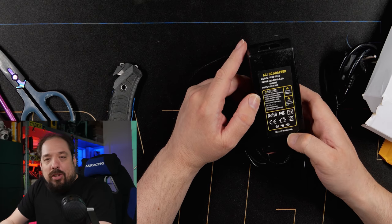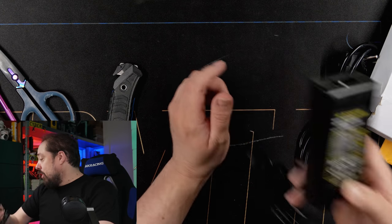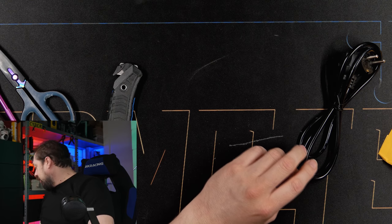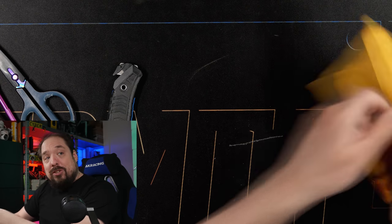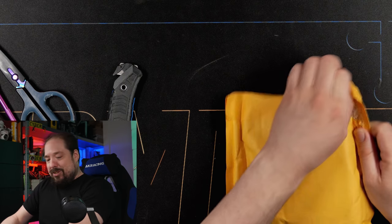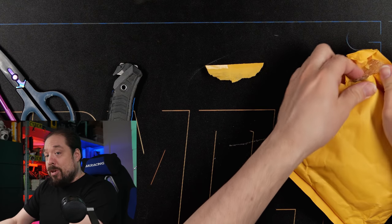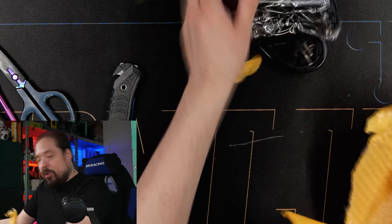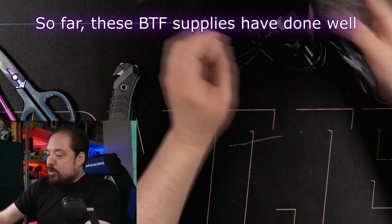Partly because in my testing of the new Quin LED modules, this is 5 volt, 10 amps, I've actually blown up a few power supplies, especially during the reverse polarity testing. No Quin LEDs have died during this testing, but power supplies certainly have. So, yeah. If you build a power supply and then you don't add a fuse in the power supply, or you don't have reverse polarity protection in the power supply, stuff is going to die.